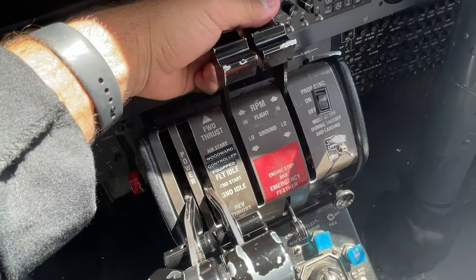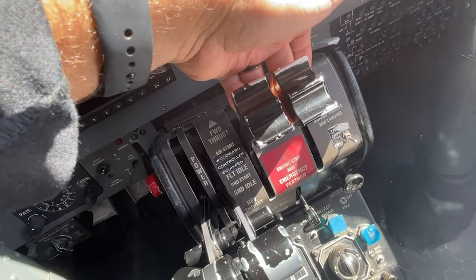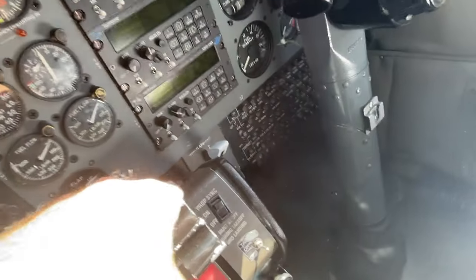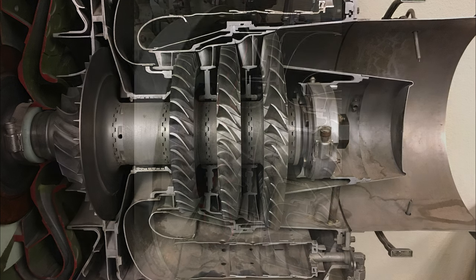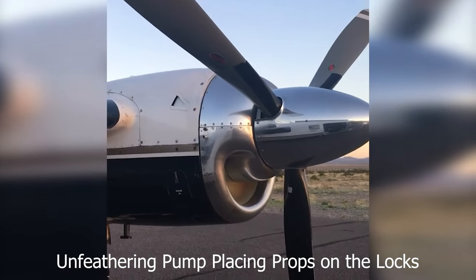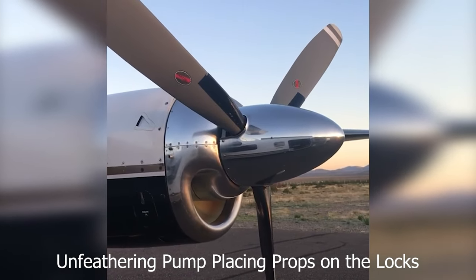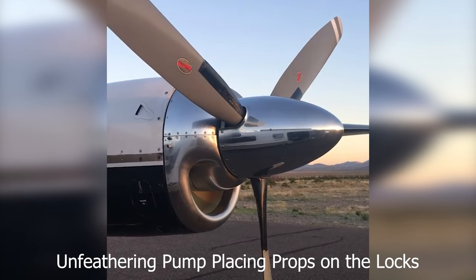The condition levers will place the props in high or low RPM. Lifting up and moving the levers aft will shut off fuel to the engine and feather the prop. For starting, we want the props in the low position. Recall that the Garrett TPE 331 is a geared engine, unlike the Pratt & Whitney PT6. That means the prop is connected physically to the turbine spool through a reduction gearbox. Because of this physical connection, we must start the engine with the propellers out of feather. If you fail to do this, the air load on the feather blades would cause so much resistance to the compressor spin-up that airflow would be limited into the burner cans and a hot start would occur. The blades are physically held in the start position by spring-loaded locking pins located at the blade root.